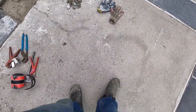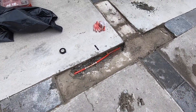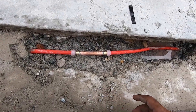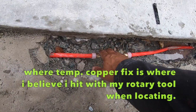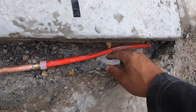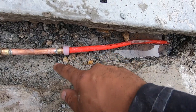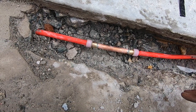All right guys, I'm at this house. The contractor told the landscaper to put in a new piece to widen out the driveway. I just put this snow melt here trying to locate it, and I'm glad I did. Check this out — it looks like a cement saw blade hit it. That's probably why the machine was always running and never worked well.